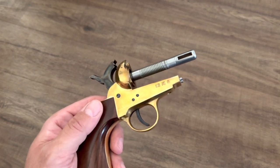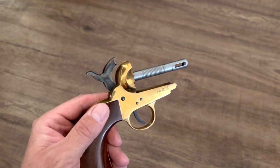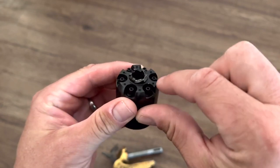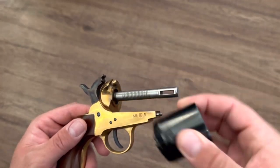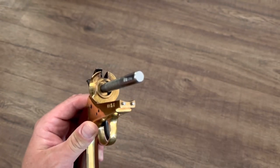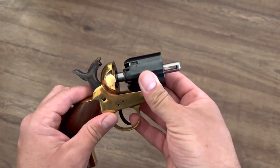I'm sure if I go back through all of my videos, there may be times when I've warned about brass frames stretching, when that's really not exactly what's happening. But as I said, I also said yes because they can become loose. If you look at the back of the cylinder — these little sharp points that the hand uses, the safety notches, and the big chunks of steel between the nipples — when the gun recoils, that cylinder can slam back into the frame, causing wear on the outer ring and also on the inner ring down next to the arbor, especially with hotter loads. With lighter loads you may never see an issue, but with hotter loads you could.